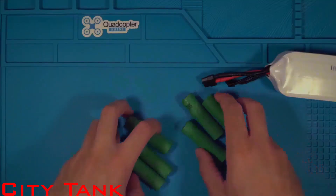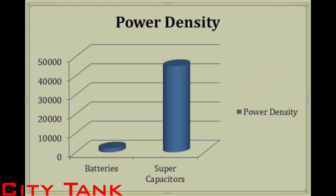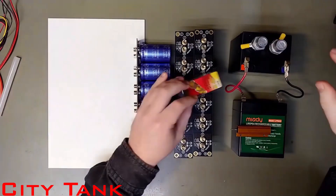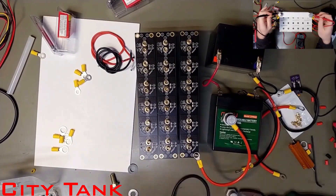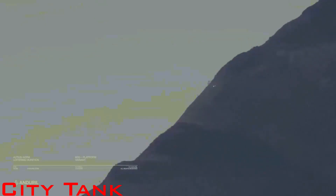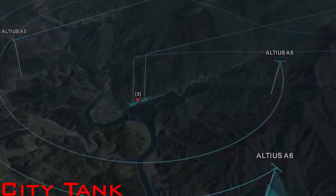If that seems too complex and expensive, there is a simpler solution using only off-the-shelf parts: variant number one is a combination of ultracapacitors and lithium-ion batteries. Ultracapacitors have much higher power density than any battery and are more efficient, but release energy over a short time. By connecting one stack of ultracapacitors and lithium-ion cells in a single electrical circuit, we get a well-balanced energy system with long-range and long-endurance performance. Ultracapacitors are best for takeoff, fast climbs, accelerations, complex maneuvers, and fast dives during attack mode, while the battery handles long-duration low-speed loitering or even hovering, and recharges the ultracapacitors in between. Notably, ultracapacitor-powered buses already exist — one Kappa bus model can run a 20 km route after just 8 minutes of charging.